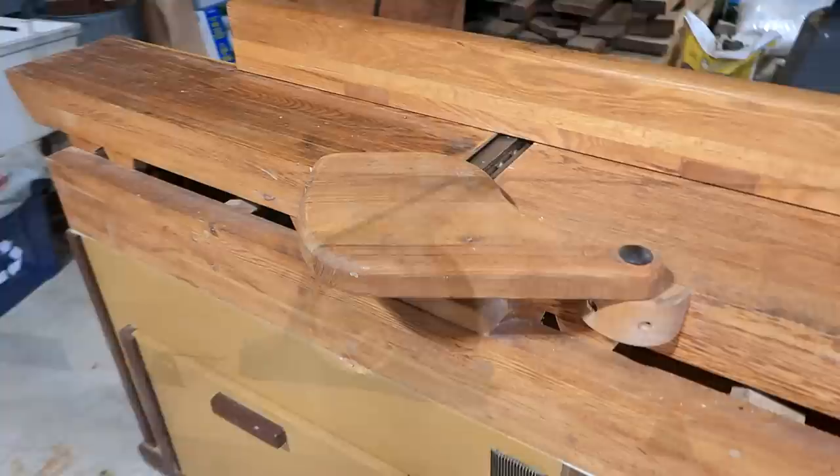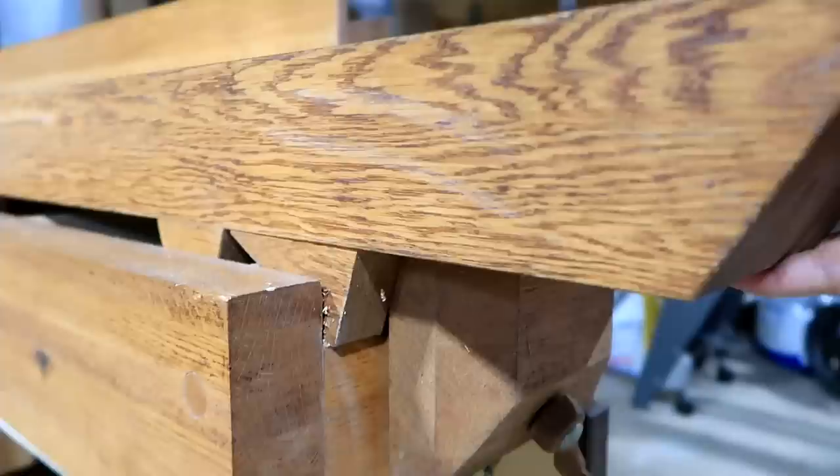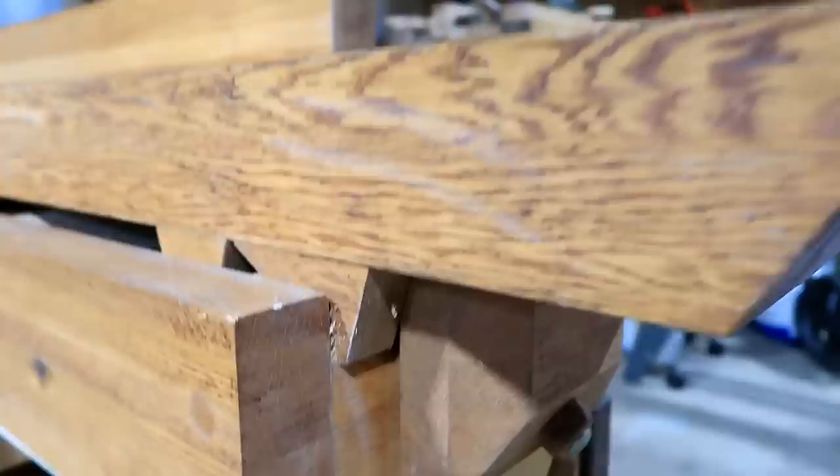The tables adjust on four slides, here and here, and what's a little awkward is there's a wing nut down in here for locking the table in place. That needs to be loosened before the table can be lowered using this nice wooden crank. Going up it's much easier — very nice and solid.